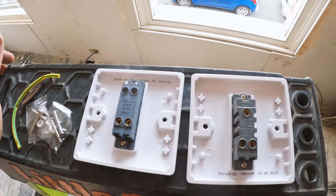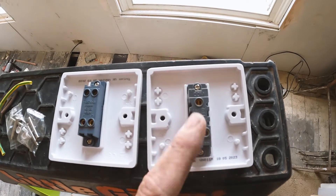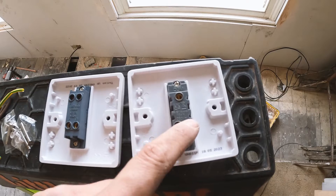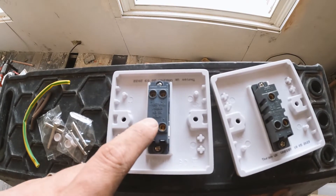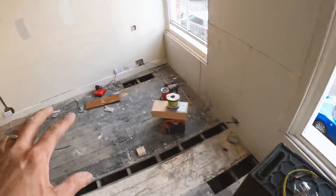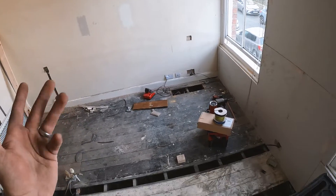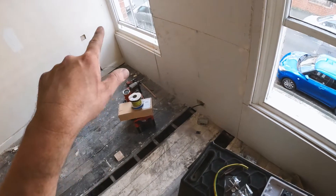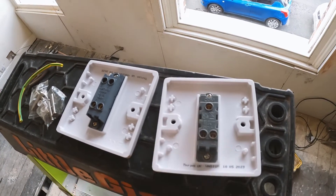So what's the difference between these two switches? We've got four terminals here and three here. The one with three terminals is a two-way switch — it connects the top terminal to either one terminal or the other when you switch it. The four-terminal one is an intermediate switch — this one connects to that, and that connects to that. When you switch it, all it does is reverse: this connects to that, and that connects to that. So on the intermediate, the common cable's brown and just connects through. The two strappers go in here and here coming in, and here and here coming out to the next switch — you're just reversing L1 and L2, which turns the light off. Flick it again, it reverses back and turns on.